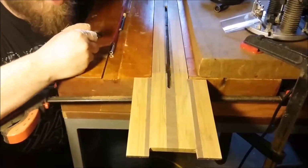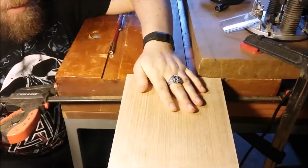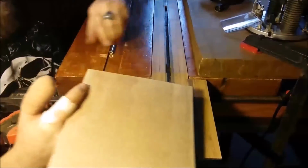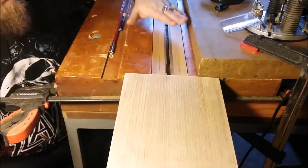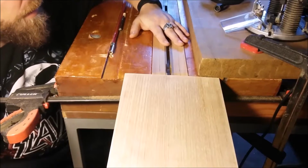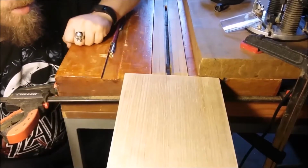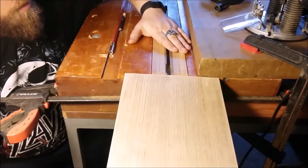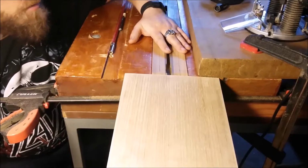I think it was an oversight on my part that I haven't yet attached the Australian oak layer to the headstock. And I call it an oversight because I am going to want that access port to run all the way through the oak. So really it would have been better if the oak was there when I was routing that out. So I am going to go ahead and leave the neck in the position to be routed out, I think. No, that's going to get in the way, isn't it? Bother. Okay, I'll take it out of here, and then I will glue the oak layer on, and then I'll think about how I'm going to cut that access port, whether I'll put the neck back into the routing jig that I have set up, or whether I will drill or file or what have you. Let's find out.